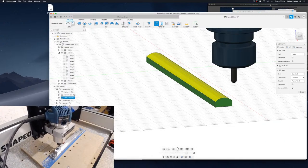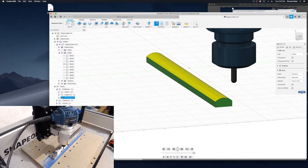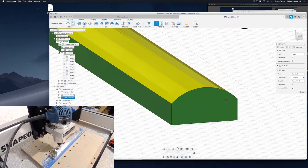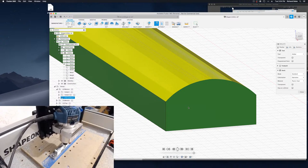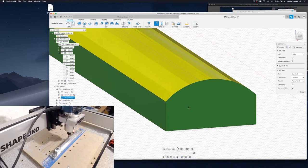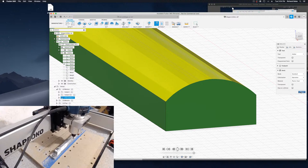Once again, this is not a perfectly rigid machine, but it worked. And so far, I've made six of them in different sizes. For the bassoon-sized shapers, the 120 millimeter shapers, I'm doing a radius of 28 millimeters. For contrabassoon, the 150 millimeter shapers, I'm doing a radius of 32 millimeters. And then for the subcontrabassoon 180 millimeter shaper, I'm doing a radius of 35 millimeters.